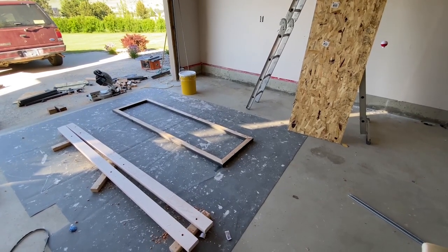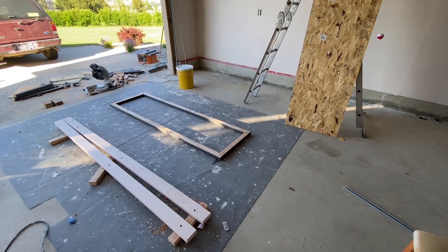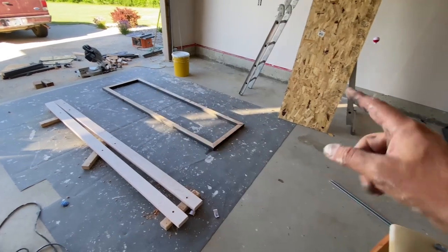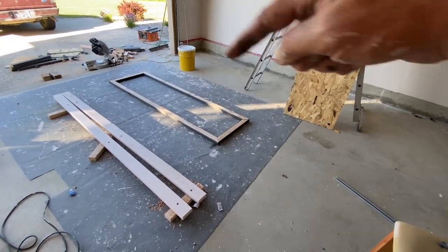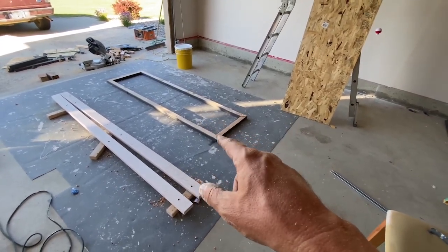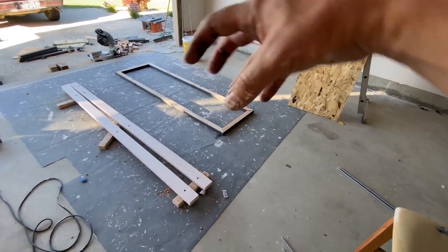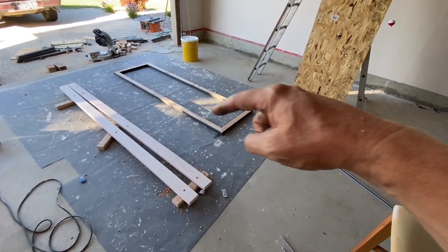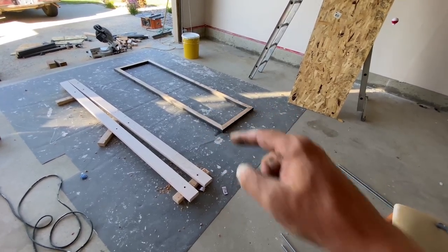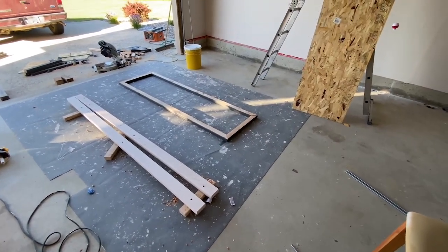If you've already subscribed to my channel, you know I've made several threaded rod suspended shelves in the past. Each time I try to perfect it — this is my own design. In the past I secured the corners of the frames first and then attached the top shelf. I'm not going to do it that way this time. Instead, I've pieced the frame together without any screws in the corners yet. I'm going to put the OSB board on top, put two screws there to suck the corner together, which I think will make it easier to keep square. I'll do that for each corner and then secure the top with many screws.